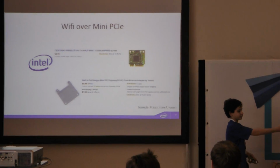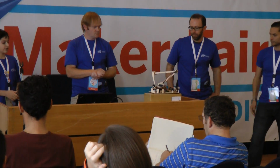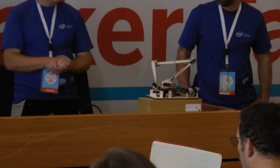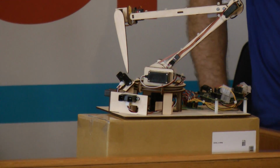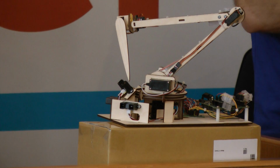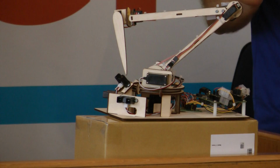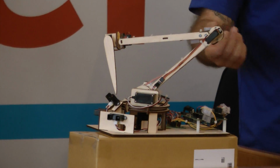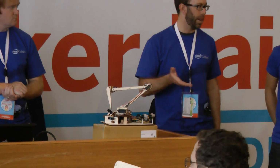So actually that's what this uses. It has a Wi-Fi module with the Wi-Fi antenna. It's just connected to the Wi-Fi network here, so you don't need to plug it into Ethernet for this. And for us, I mean, Carlos is a programmer, but I'm a designer by training, so I come from a completely naive background. Once we got the board in and the files on the SD card, we just ran the Arduino example Wi-Fi sketch. So you just load that up and it works.